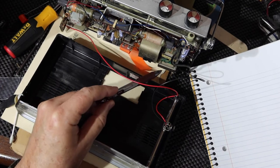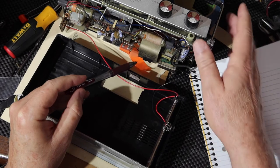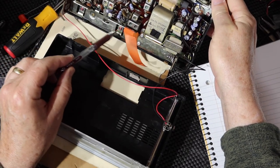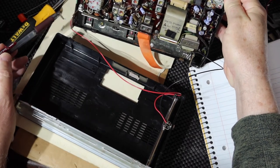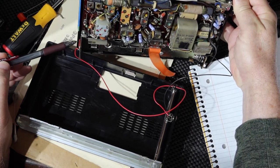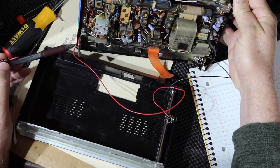That will run down. I'm going to take this back out of the chassis, out of the case, and I'm going to run it underneath this metal plate where the batteries go. I'm going to just run it along here. It's DC. It's not going to cause any interference. I'm going to bring it along here. I'm going to disconnect the lead that goes to the radio, which is here. That'll be the output. And then this one will be the battery source one, if you will, that goes to the switch.